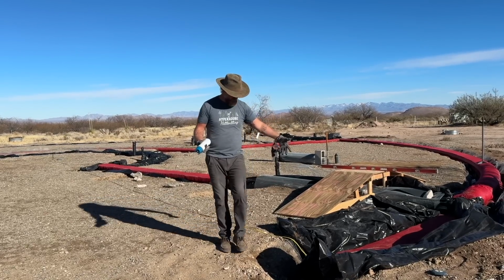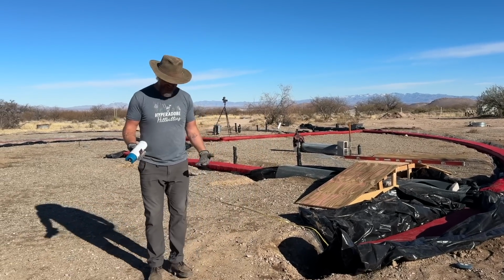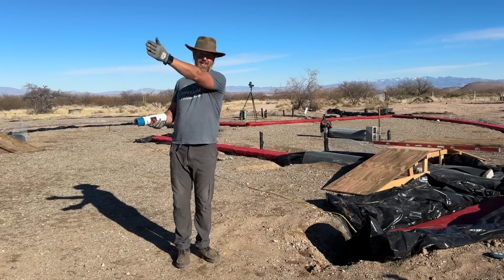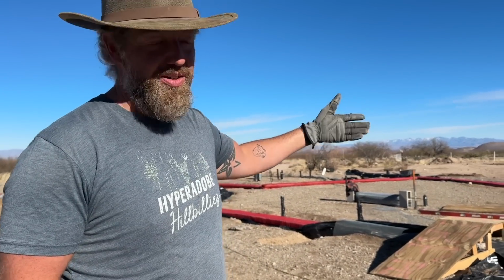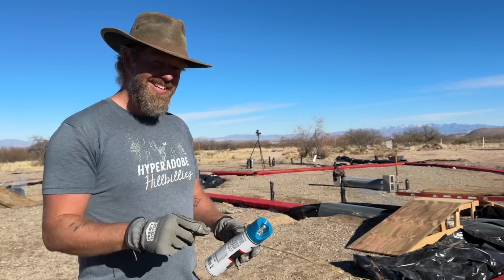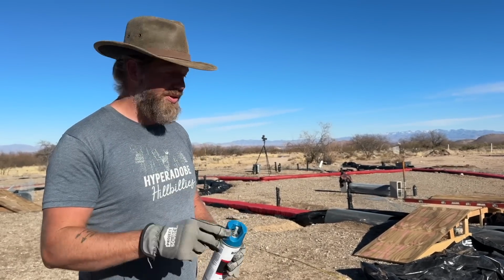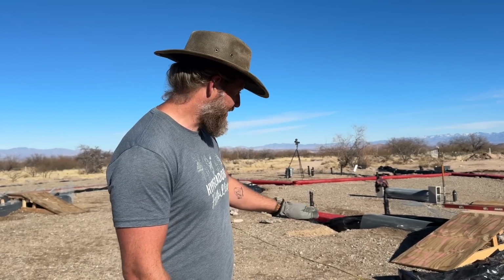But standing here and looking at this, if the rain comes in, it could still hit this door. So we're just going to dig this trench out, not too much further, maybe to here, because we don't want to block that view of the mountains. We just want a little more protection for that entry and exit. So we use our tape measure and the compass, mark it, and dig just a little bit down. We're just going to give it a little toe hold. It doesn't have to go the full distance down because it's a small wall. I'm going to mark that, trench it out, put a little gravel in it, get it to match up with this one, and then we'll lay it and it'll be good.